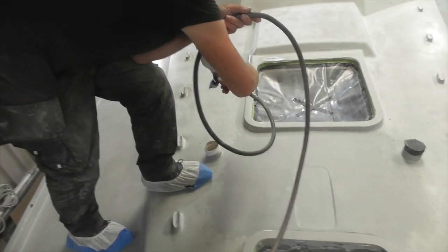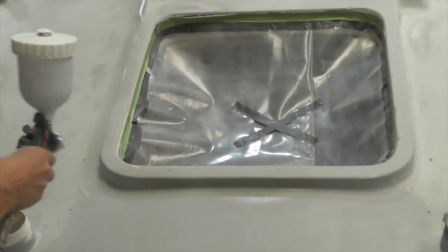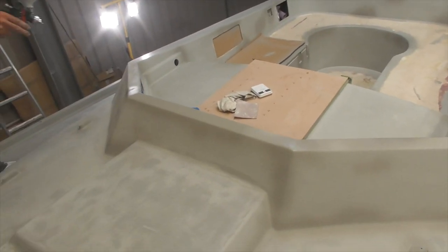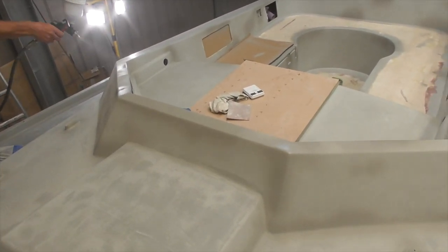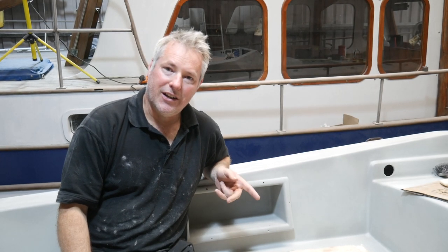That's the end of this update. A couple of days back I got Robin and we went around and put three layers of primer on using his spray equipment, just spot-filling anywhere where I'd gone through the primer back to the substrate. I was a little bit concerned because Rob did seem to get quite trigger happy, and ultimately it was up to me to do all the sanding. I've just spent two full days with a 400-grit foam-backed pad just hand-sanding everything again. But it's done — I'll never have to get up here and sand again in preparation for painting. That's a massive milestone.